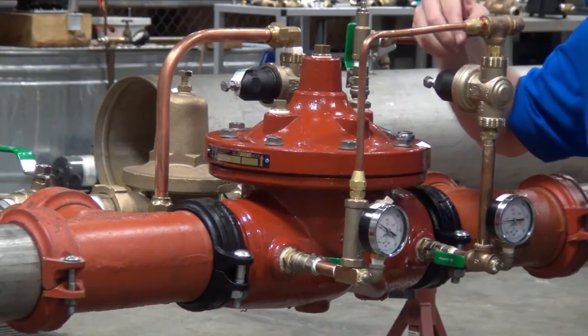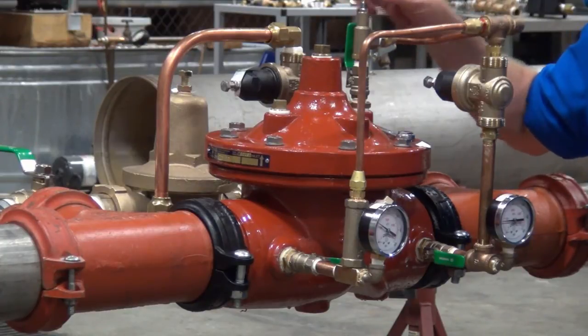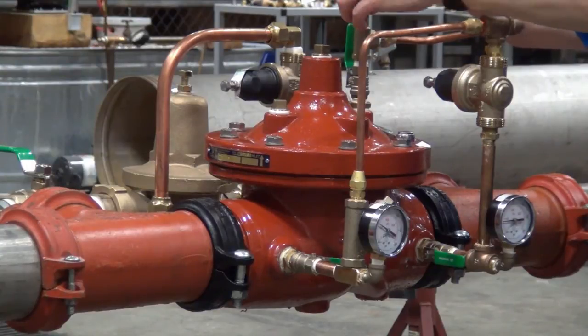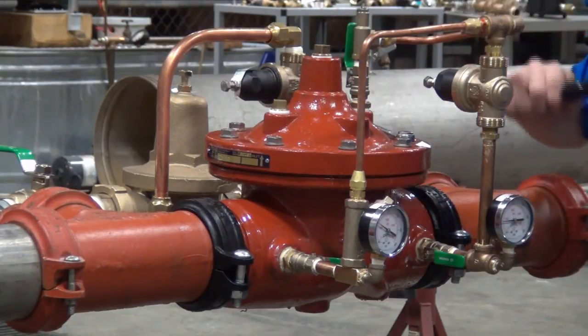We might also fine tune our opening and closing speed controls. I had the valve opened and closed on the downstream side just to make sure that the whole pilot-operated PRV was reacting in the fashion I wanted — and it turned out to be so. We basically locked our speed controls down at that point. The valve was not surging open too rapidly, nor was it closing too slowly to develop a surge downstream or too fast to develop a water hammer upstream. So with your opening and closing speed controls, once you get the pressure set, fine tune those controls. Open and close your downstream water flow and make sure the valve is reacting in a fashion that doesn't develop surges or water hammer.